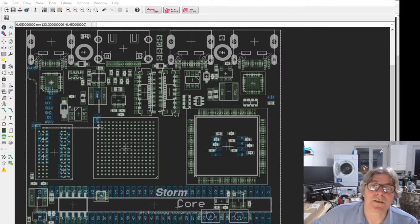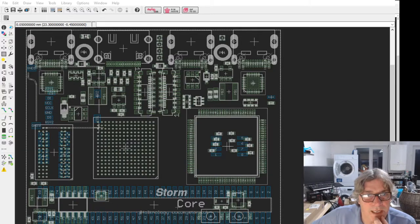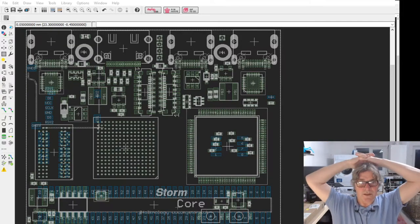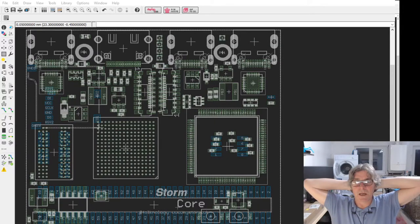So it depends what you want to use it for, you see. If you're going to do the higher end video-y stuff, then clearly you're probably going to opt for the high-end 45F version. Whereas if you're perhaps doing something less arduous, then you're possibly going to consider the 12F version. You might not need that much memory. You might not need the 400 megahertz STM32. A 216 megahertz F7 may be good enough for you. And you might not need such a large flash.